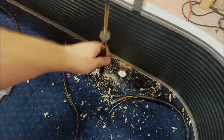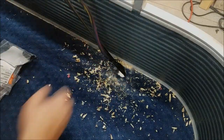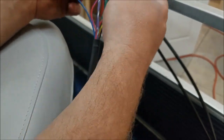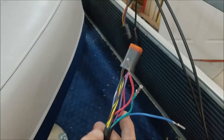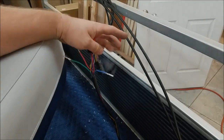Let's get our cables in first. Alright, we'll do the 6-prong first. This is our mating connector. I now notice that none of that was in frame. When I do the other side, I'll make sure you can actually see what I'm doing. So that is the main engine. Now the power trim and tilt, which is the 3-wire. Do that next. Use our plug body for it.